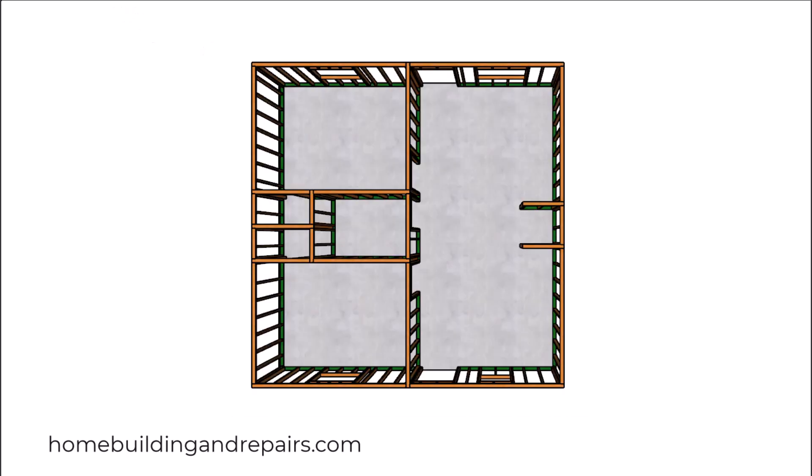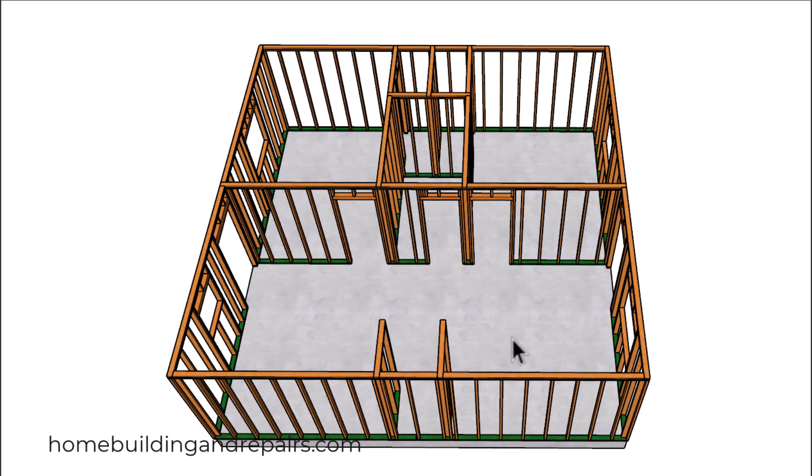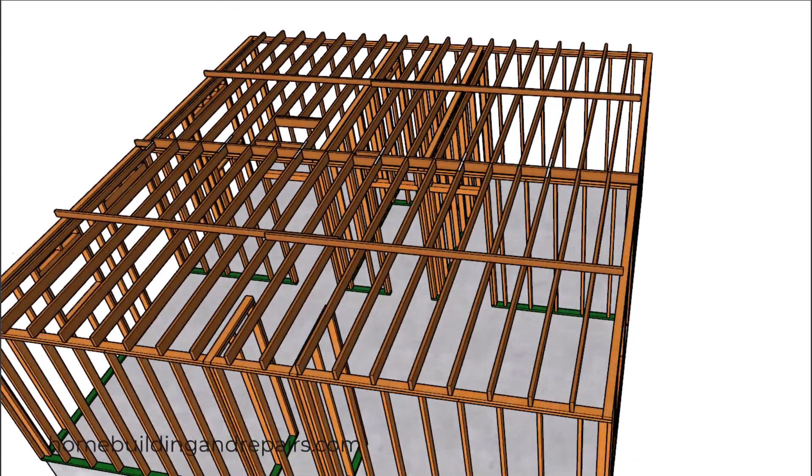Let's go ahead and remove the roof. We have a two-bedroom, living room, kitchen, one bath, and a couple of closets. The heating and air conditioning unit can go above the ceiling. We will be conventionally framing this house, so we're going to have two-by-six ceiling joists that line up with each other, even though we don't have to, because our roof rafters aren't going to line up.